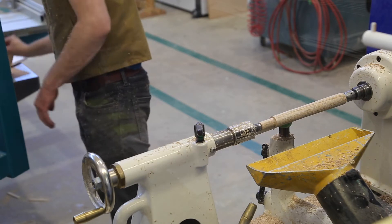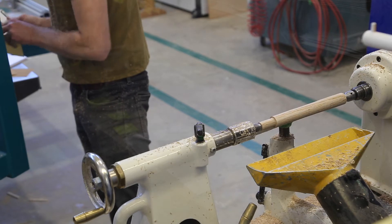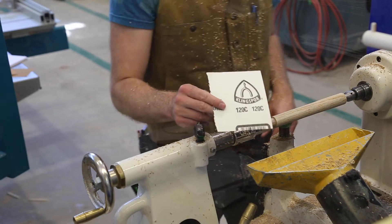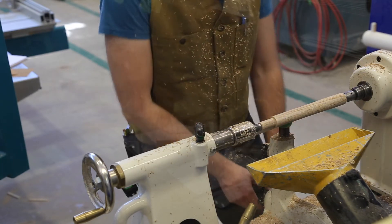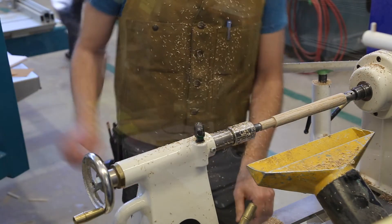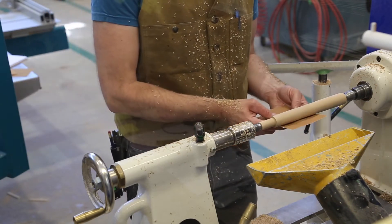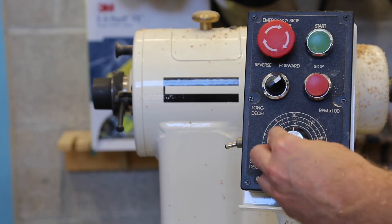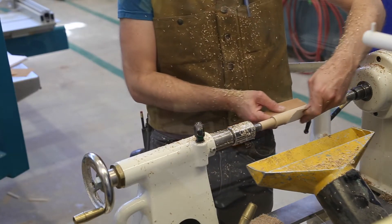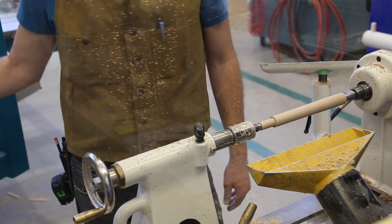From here, I'm just going to grab some sandpaper. I want to leave it a little bit oversized so that I can sand it to a finished quality. I'm going to start with 120 grit and work my way up to 180. Starting the machine up again — just remember that when you're sanding, you can actually turn the speed up quite a bit and work more efficiently. I think that looks pretty good.